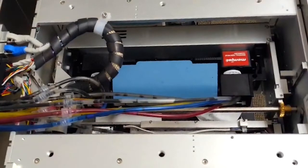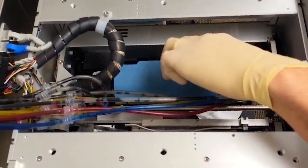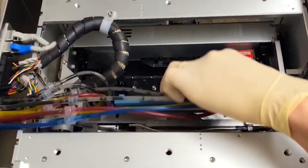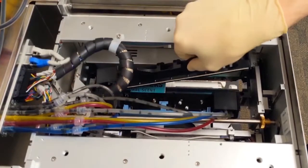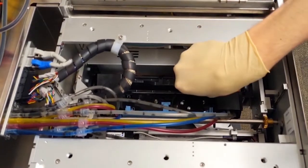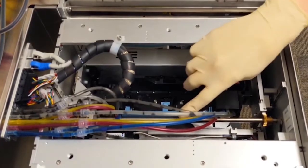On your new T2-C, the printhead latch should pop open automatically. Lift it the rest of the way open and remove the protective caps. Insert the printhead at a slight angle, then push forward to make contact and snap it into place. Push the blue printhead latch down.